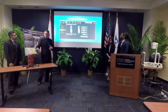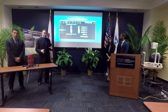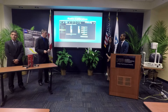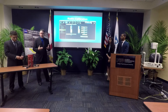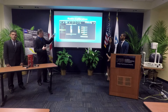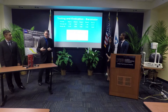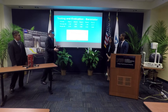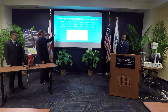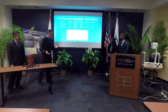Here is some of the work involved in programming. We performed radio calibration for the emergency fail-safe — ensuring that at any time, if something went wrong, NASA personnel could take over the quadcopter manually. We also had to determine the expected pulse-width modulation values, because the Python scripting needed to spoof the radio frequencies. We tested the barometer — which we used to measure altitude — running five tests over ten seconds. The average reading at ground level ranged from about 1.29 feet to 2.17 feet, showing a relatively small variance.